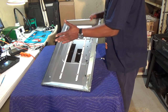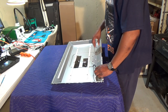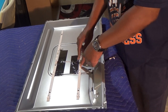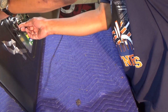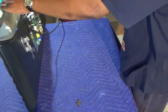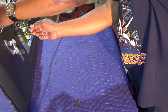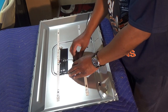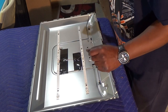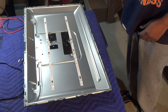As you can see, just two strips — should be pretty straightforward. The actual connections are right here in the middle, so those are our test points, and the power comes in from the power supply board. I'm going to disconnect the LEDs from the one-board wonder power supply. There's one line going here — I'm not going to pull this tape off — and I'm just going to unplug it from right here to test. It's like day three now.